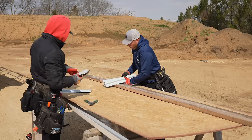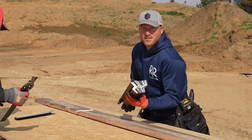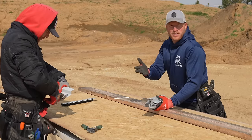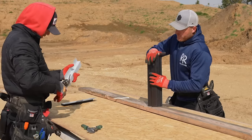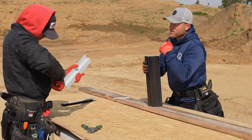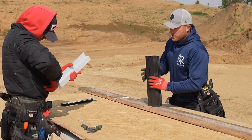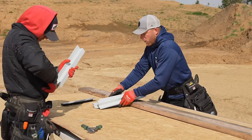Greg and I have to cut all of these pieces of trim — these are the Z flashings that will hold down our trims and be fastened to the roof deck, but be hidden and not able to leak because water can't get to them. It is a lot of work. I don't know if a manufacturer pre-produces these. If they manufacture their panel, they'll know exactly what the width is and can produce standard Z clips, but we don't have that right now.